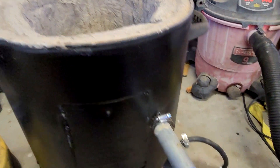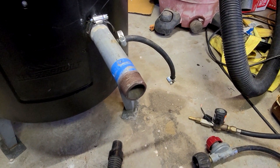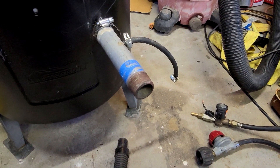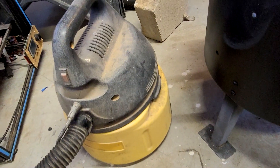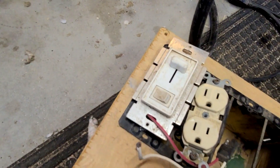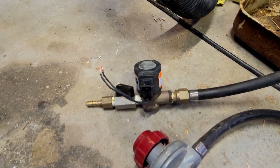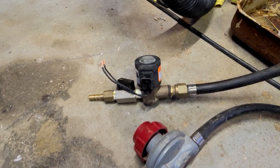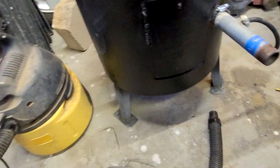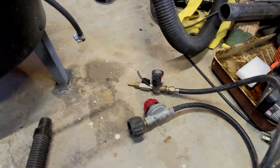While we're waiting for the 100HT to dry, I want to go over the gas system I use, as it's a little different than a lot of other YouTubers. They use a Venturi system; I use a forced air system. The components are: an air source, which is this Harbor Freight shop vac that's been awesome; a dimmer switch to control the output of the shop vac; and for safety, I put in this gas solenoid that allows me to cut the gas off with a flip of a switch. Since we're doing a new forge, I want to put a little control box together.